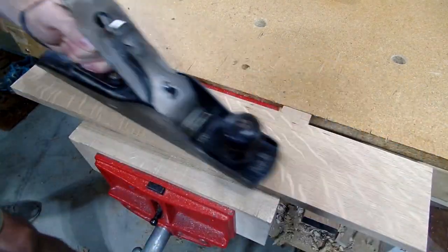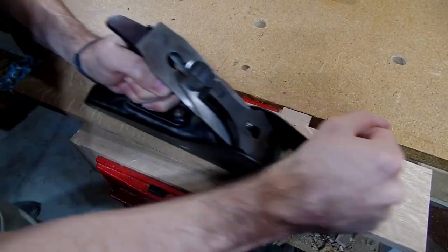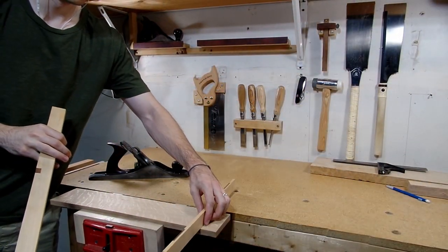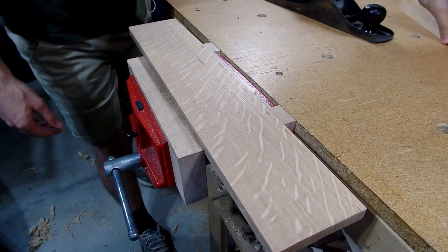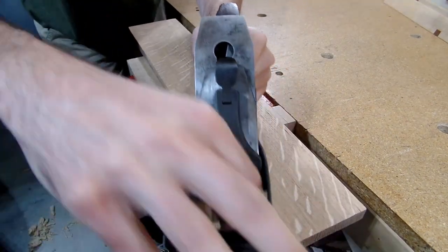With the money problem solved and some planes gifted to me by a friend, I set out to begin making my own tools. Naturally, one of the first tools I made were these winding sticks I'm using here. If you want to dimension and square lumber by hand, you'll inevitably need a pair of winding sticks, which happens to be the first tool I built in this series. On one of these sticks are two darker pieces of wood set on the edges of the stick, and the other stick is blank all the way across.